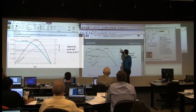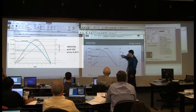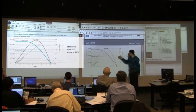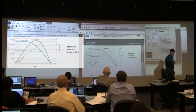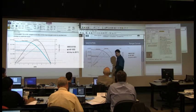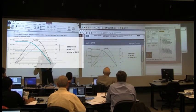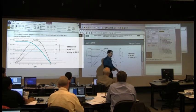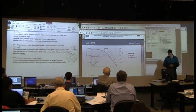In this case it's 225 watts roughly peak, and at that same point continuous it's 135 to 140 watts — so you're looking at 60 to 80 watts more, and then multiply that by the number of motors you have. A switch-mode power supply, when you reach its peak, it craps out — it just knocks off line and resets. An unregulated power supply, the voltage starts going down before it does that. So be sure you size that power supply accordingly.